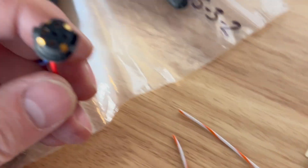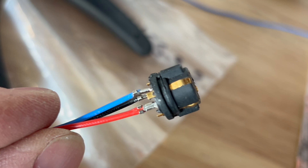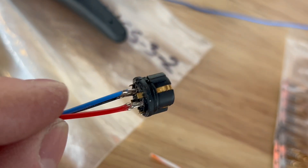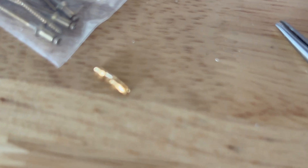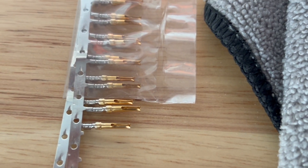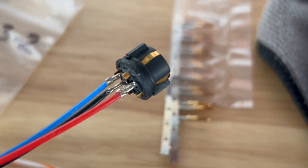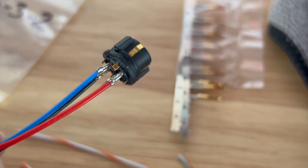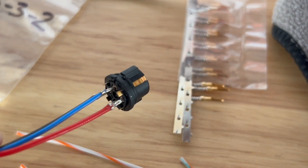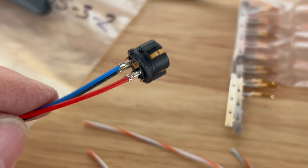This is the face of the connector that goes in, and that's a proprietary Garmin piece. I removed the molded rubber backing to expose the pins, and I was able to extract the original Garmin pins. Using some connectors that I had — some Molex-style connectors — I was able to crimp on new wires. I'm going to attempt making a back shell or some kind of housing for this. Wish me luck, let's see how it goes.